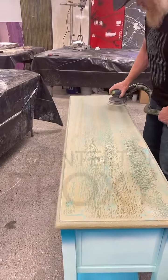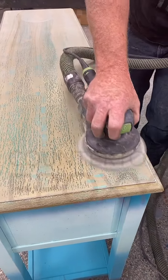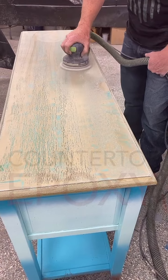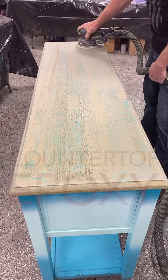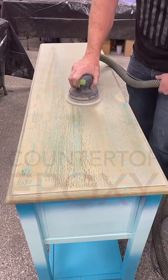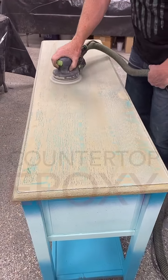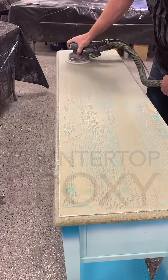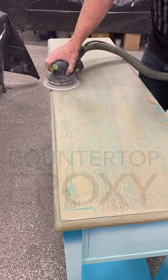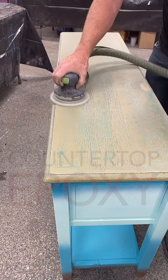Okay, 1,000 grit. Remember, I want to just put in a little bit of time. This should be pretty quick. And a lot of times, my success here is very dependent on the fact that I spent adequate time with the cutting grits before this. Like, did I really adequately cut it with a 600, or the 320, and all of a sudden now you're at 1,000. This is usually when you'll start seeing areas you missed, or if you were a little rushed, or you didn't overlap your strokes each time.